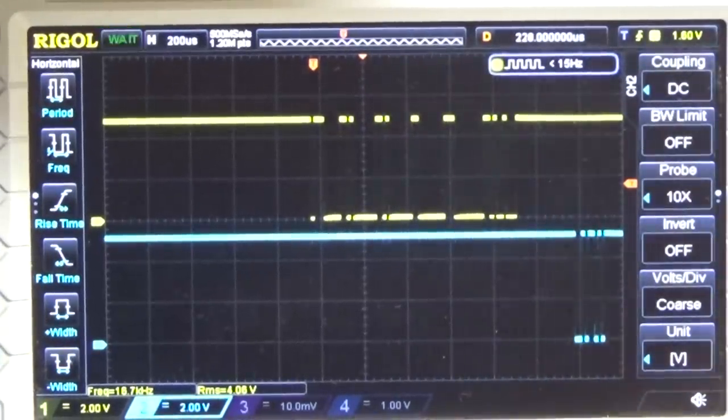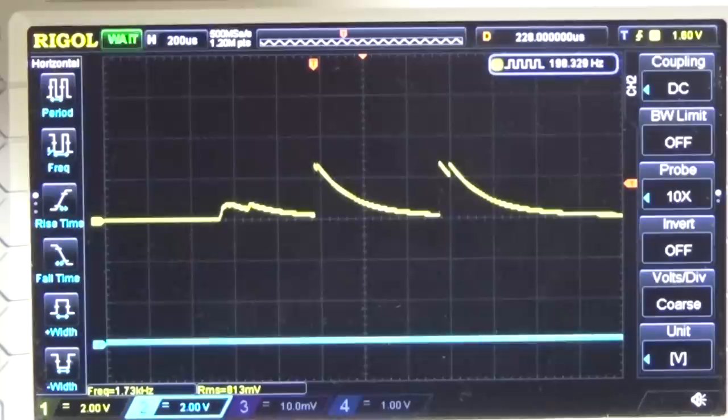And of course we can simulate it live and still have my probes down at our communication connector, right? And now I press our on off switch, and yeah, you have now seen how our processors are communicating. And that means our front panel and main processor communication is just fine. And that fits what we have found earlier, that the radio is completely operative, so that I can dial the frequency, that I can adjust the volume control, that I can switch between FM, AM and SSB.